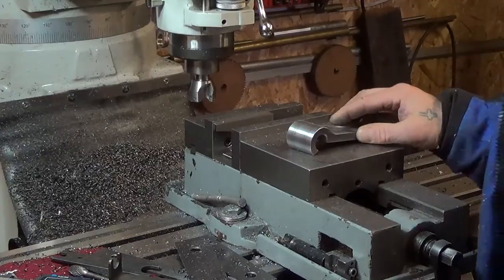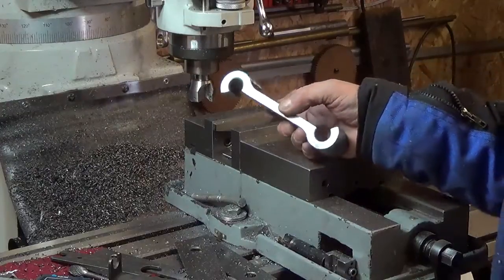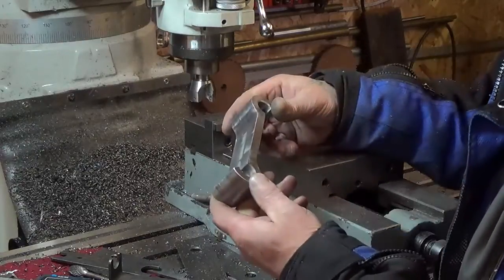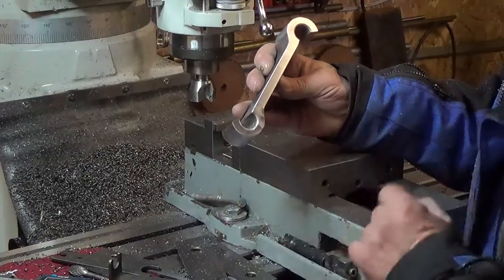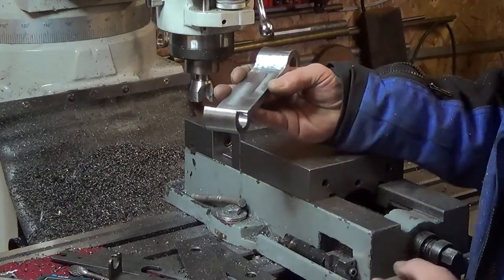You caught me blending. I won't try to bullshit you and say that everything turned out absolutely perfect — I did have to do some blending in the corners. Next step will be to cut off this side, get it smooth and square, and then we'll mill our slots for our adjustable bolts.